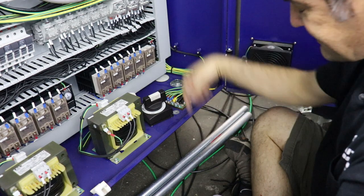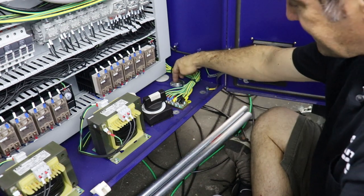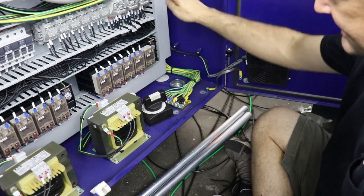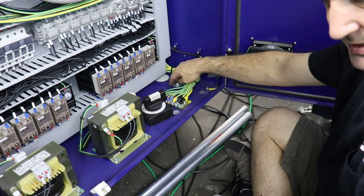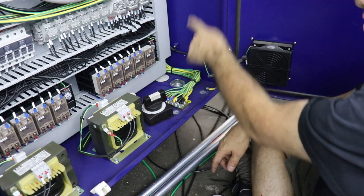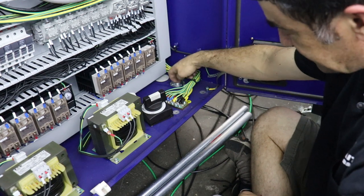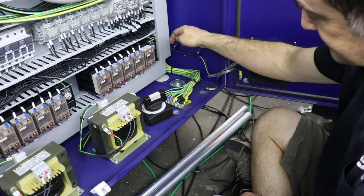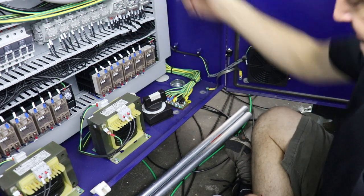So now that box will connect our conduit up through the box with the wires that poke up through at basically a tight 90 degrees. You can't really use these while you're running wire through long runs of conduit. You really need the long radius so that the wire doesn't jam up. But at the end of your conduit run, you can use these LBs that will bend the wire at a sharp 90 degrees and then bring it up into your cabinet to hook up.